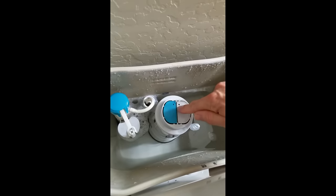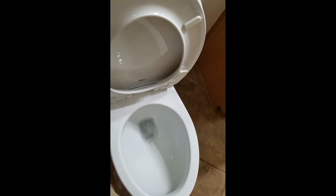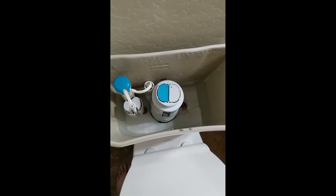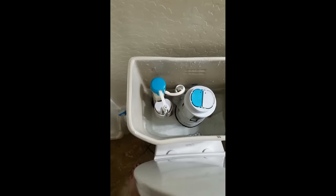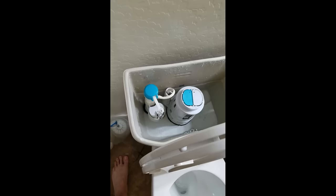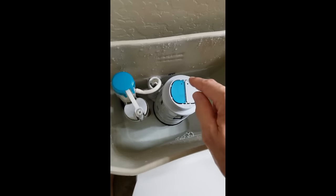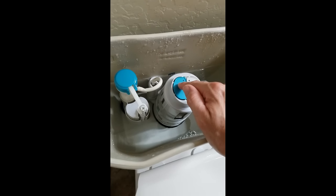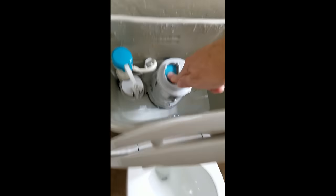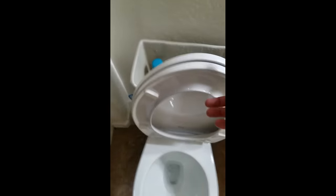That's how much water we've got. Doing the max flush — those are the results I'm looking for. That's a definite improvement from when it was set at minimum; now it's maximized. Comparing with the minimum flush setting, there's quite a bit of difference. I'd suggest having your full flush maxed out — you really want to get the flow through there and not leave any debris in your plumbing. The half flush at max is almost like the full flush.